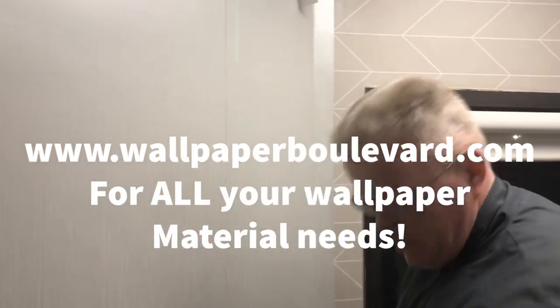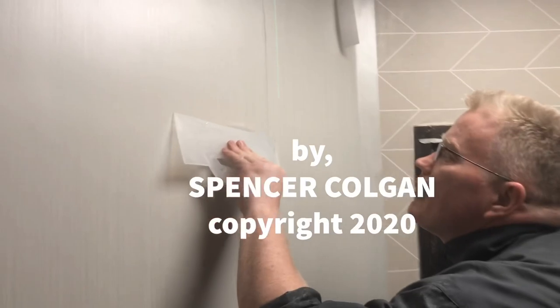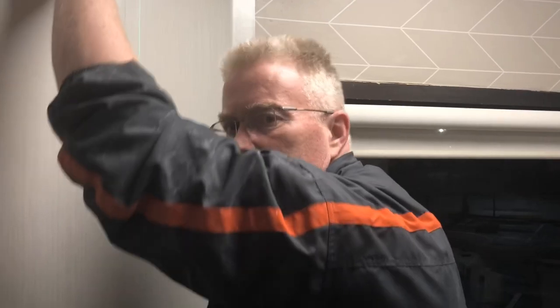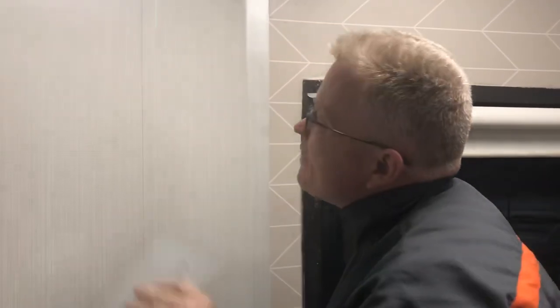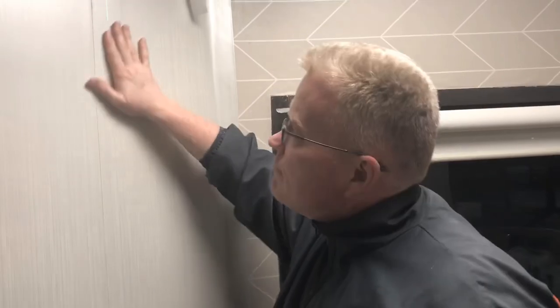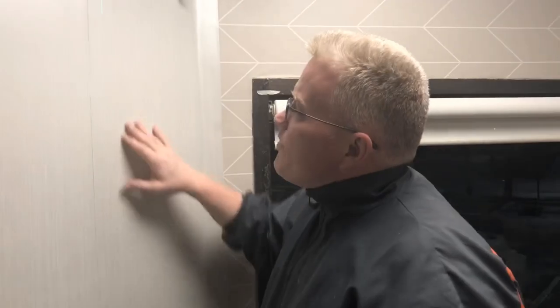Now, your cuts are no different. And the dents just come out. Okay. So now, if you don't have a laser level, you're at a disadvantage. Because on a long cut like this, there's nothing on the wall covering to guide me to make a straight line. I could put a piece of tape on here that's guided by a level, but since I have a strong laser level, I have a green line here. This is what you want. This is how to make it right. So we'll go ahead and do it.